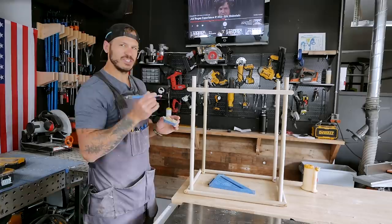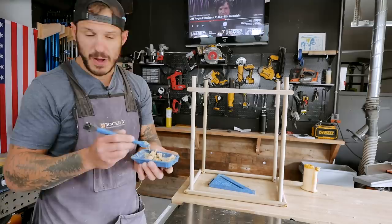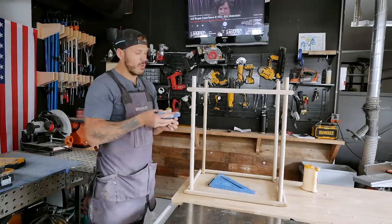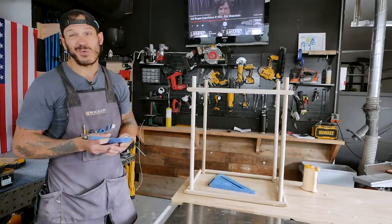I'll be completely honest — this is probably the first part of this project that I'm not stressed out. I was encountering problems I didn't anticipate, like the circular parts and creating miters and how difficult that would be. If you have a miter or two that's off a little bit, no problem. What I like to do is take the sawdust from this wood species — which is poplar — and mix it with wood glue. Not too much, because the wood glue will prevent the stain from coming in. I'll pack it in, and once dried, the stain will absorb far better than wood filler.